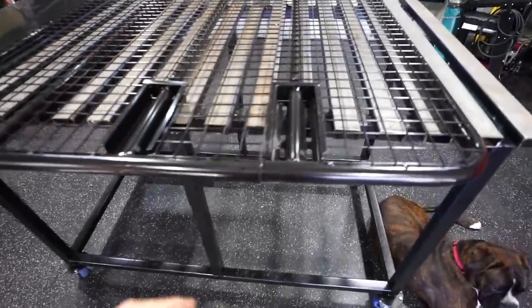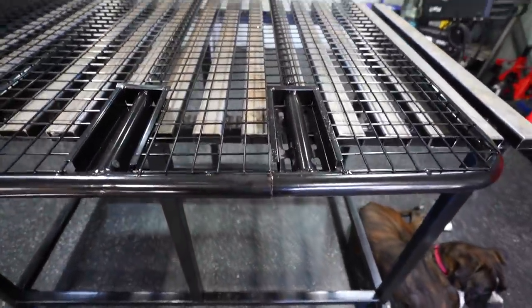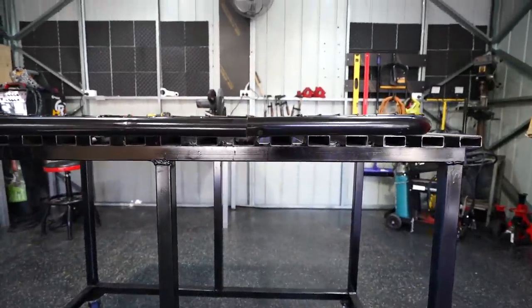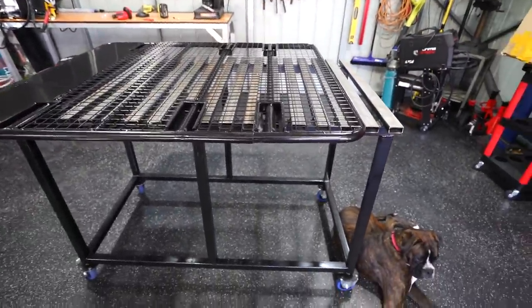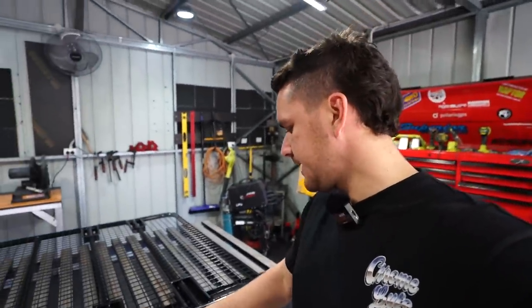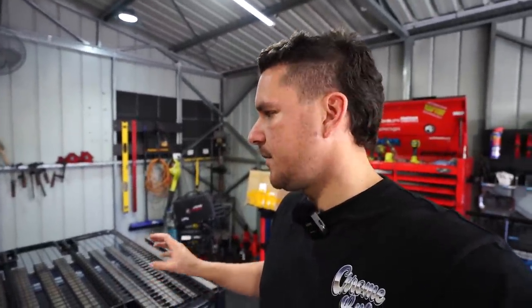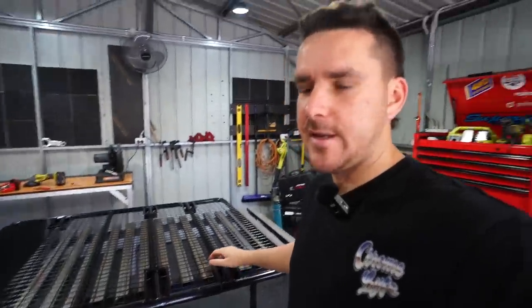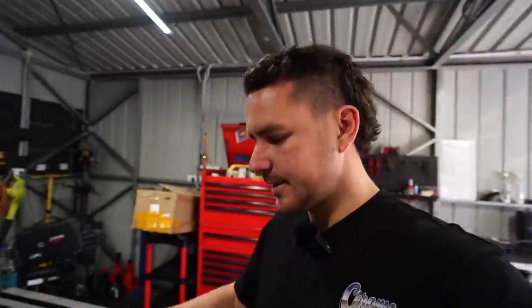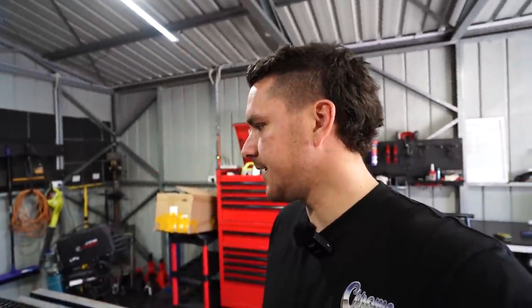So far so good - you can see we chopped right down the middle and she's looking pretty good. My main concern is that it doesn't look bent when I weld it together, so we've got to make sure they are perfectly parallel with each other. Ideally I'd be putting a sleeve in here to help with some of the weight, but I don't think much weight will be going on this, and it's also going to be bolted down to the car itself as well as being welded. It's not a hanging weight - it's got its own feet, so I think it's right with just a seam weld around the outside. I'm going to start lining everything up and tacking it all together, and hopefully we can get this seam to look as factory as possible.